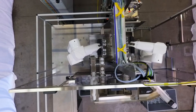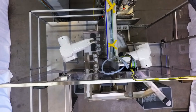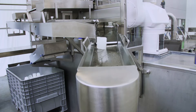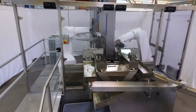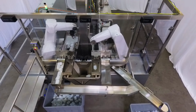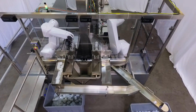After cutting, both robots empty the bottle halves with the human plasma core into the draining trough. From there, the plasma slides or flows through the guide channel into the defrosting tanks. Sensors check that the cut bottle halves are completely empty. Then the empty bottle halves are placed on a discharge rail, which leads to a disposal tube.